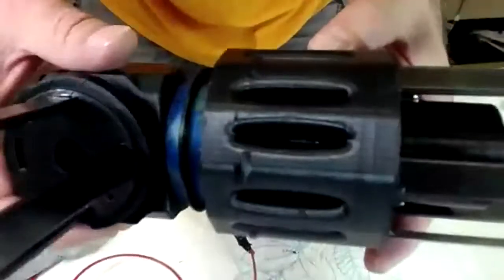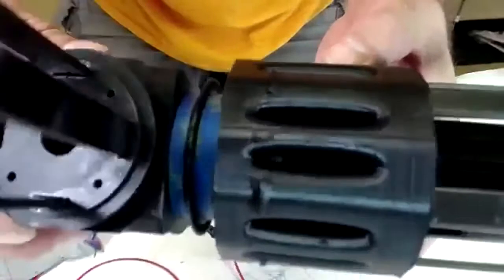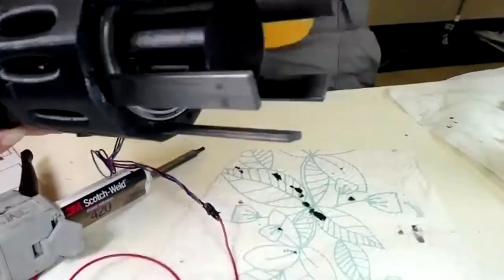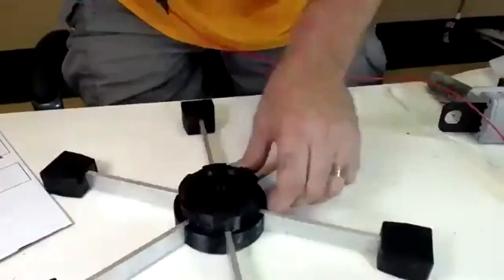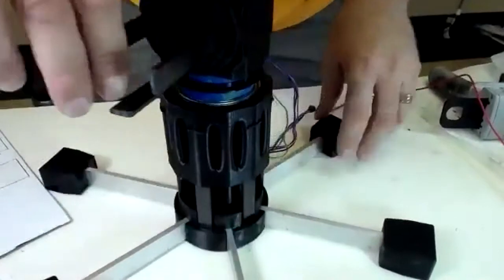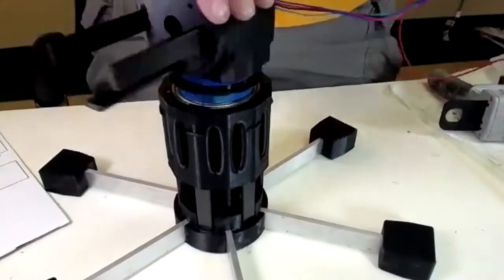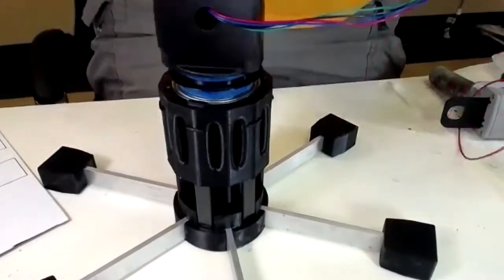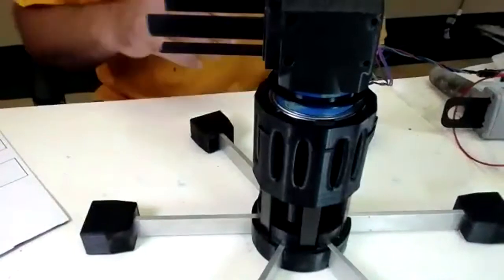So what that's going to do, and this pivot disc does not go in the base, we're just going to let the pivot cure this way. And the easiest drying method is to take the base and just kind of set it in here and give it a turn. That way you know everything's centered and aligned, so it's curing in the right position throughout the whole assembly. And you will let this dry for at least 2 hours.